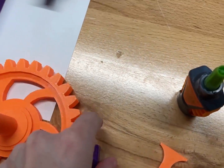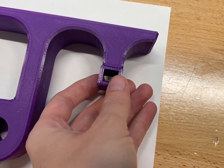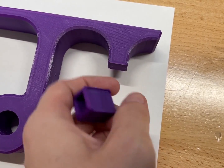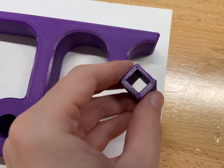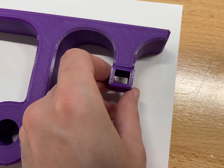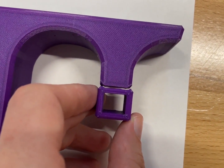The funniest thing happened — I modified this in the 3D model and made it a different object so I could keep it the same size while scaling everything else up, since the motors are the same size and I can't get two-times-size motors. But apparently the slicer viewed the middle as a void and printed it that way.